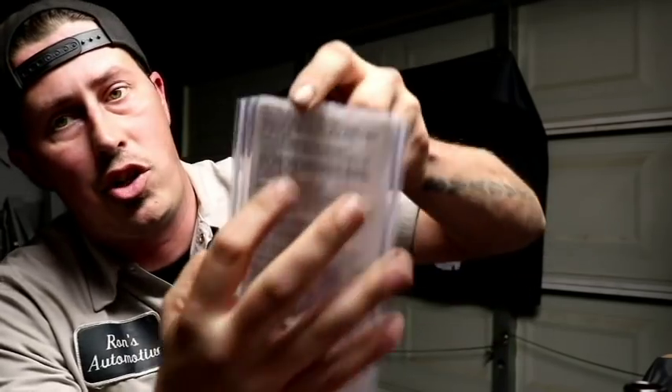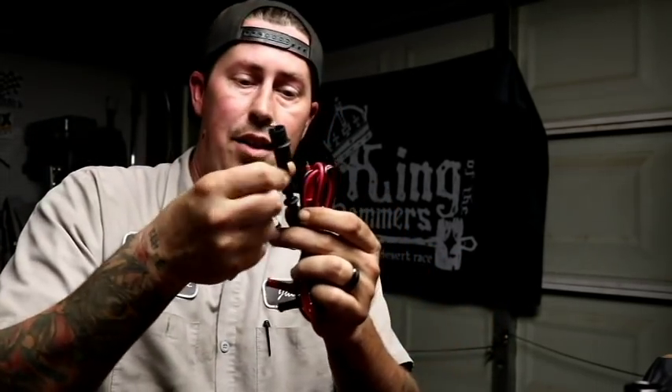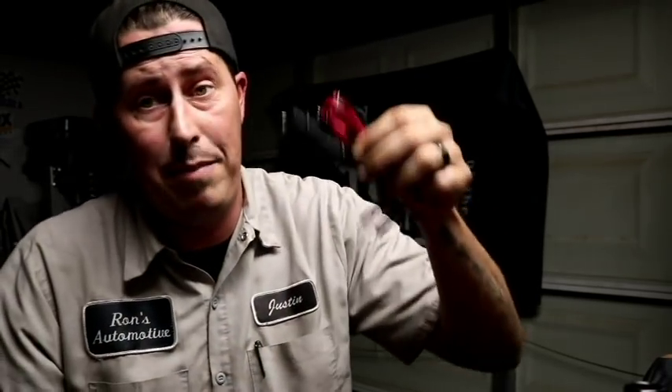An easy fix: I picked up a different set of test leads at Home Depot from Klein — about $17 or $18. Before I talk about the added benefit, make sure the leads are rated for the same voltage parameters as your meter — this is CAT 3 rated, not CAT 4. But these leads are a little bit longer, and instead of just pulling the top off, you have to unthread it, take your adapter, screw it on, and now when I clamp it onto a ground that baby is secured. I'm making contact, so I can be confident that the voltage and resistance I'm checking are accurate. For an extra $18 it's a nice upgrade.